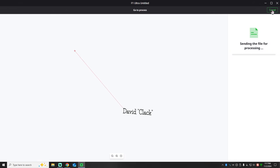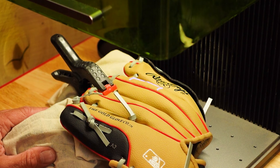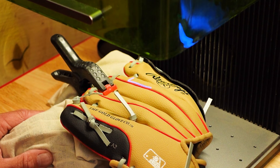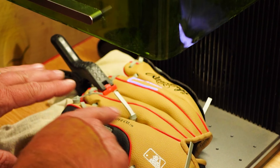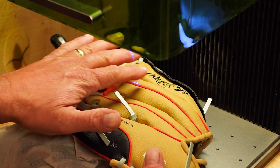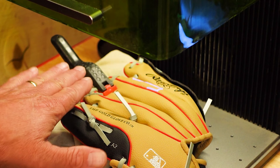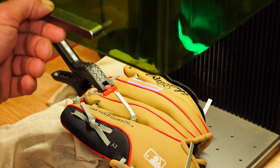Preparing for preview, we're going to hit start and I'm going to walk over to the machine and hit the button. So over at the machine, the frame is a little off from where I want it, so I'm going to manually move the glove — I find that when doing this type of framing operation, sometimes it's easier just to move the object by hand than to try to move it in the software. I'm also going to make sure I've got that as flat as I can get it, because I want to try to get an even burn. That ridge and valley is going to be a little challenging for making sure my Z axis stays correct. We're going to go ahead and hit 'go to process' on the machine. Here we go, let's see how this works.